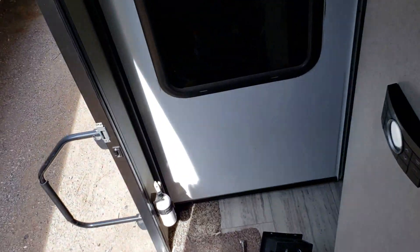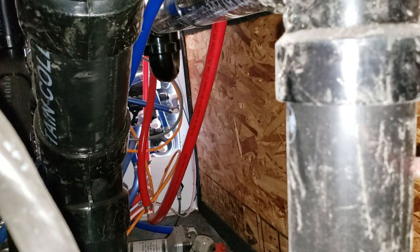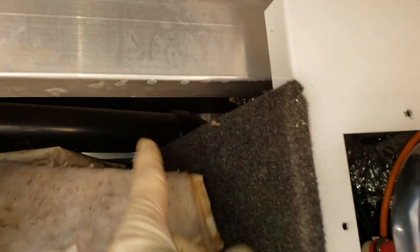It's good to always find that vent stack, which is why I removed the electrical distribution panel here so I can see inside the wall. The service access for the plumbing on the outside — you can see light coming in through there — gives me pretty good access to get the wiring around. I can go up through here, secure it against the framing, and come out right where they already have a wire going, then follow it over to the regulator or the batteries. I personally think it's nice to be able to see the display on that panel, but I haven't decided how important it is to see it in the bathroom. I'll give it some thought — maybe I'll call the customer.